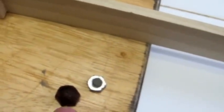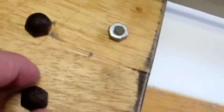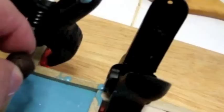The nuts for registration keys — I forgot to put them in this mold, but you'd place one at each of the four corners. With very small molds you might be able to get away without them. My mold came out fine, but with bigger molds you'd want to use them. And there you go — the four clamps nice and tight.